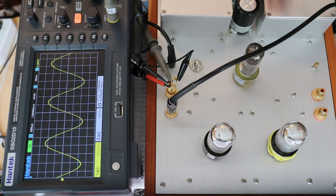It's also a high gain tube, lower than the 12AX7, but with a mu of 70, it's in the high gain category. And I don't think we mentioned that, actually. The higher the gain, the more microphonic they tend to be.